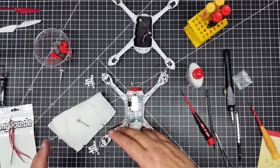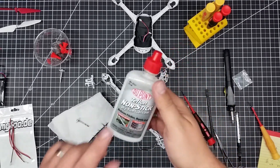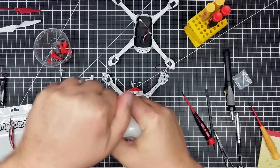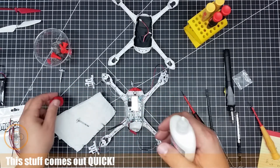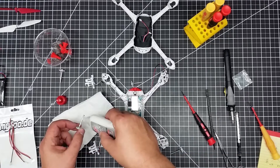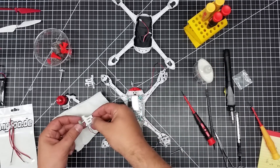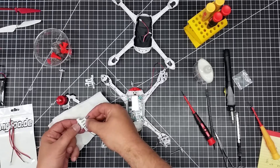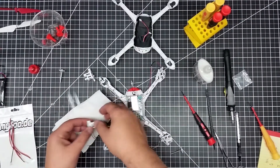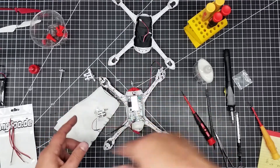What I decided after looking at this is to lube the assembly before putting it together, because of the way it sits on a little pin down there. I've got my Teflon Nonstick Dry Film Lubricant. You have to really shake this up good - make sure there's nothing still left at the bottom. I've got a little paper towel here. It doesn't take much - just basically a drop or so. I'm going to take this and work it in here and work it back and forth. I cleaned off the old grease beforehand. I'm going to do this for all four.